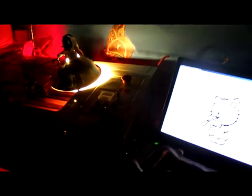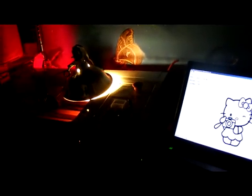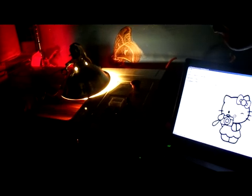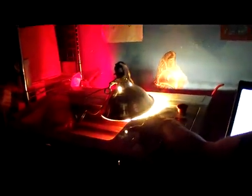When you are jogging, please keep in mind that you don't want the laser to hit the walls or the sides. It's just better for the laser, better for the machine. It's a pretty delicate machine. So let's jog it up. Since we don't have the guide laser right now, I'm just going to do a test shot to see where it is. As you can see, it's right there, so I can gauge from that test shot that I want to jog it up a little bit more.